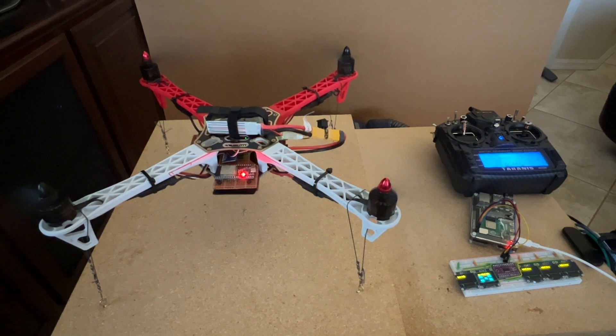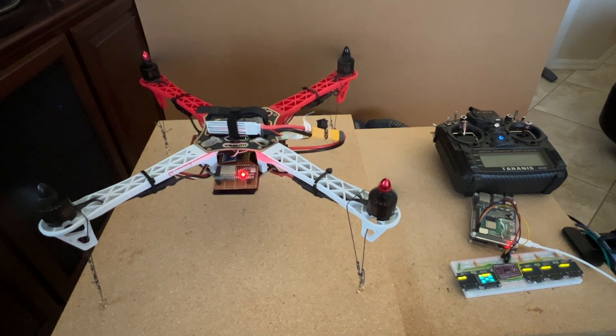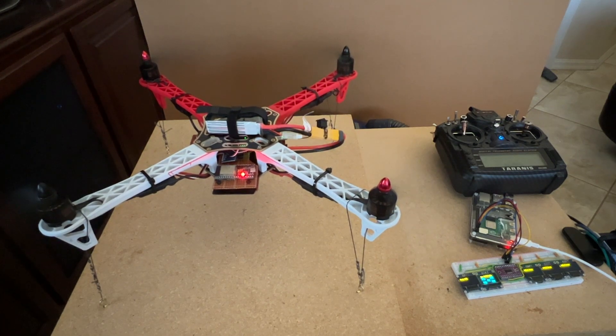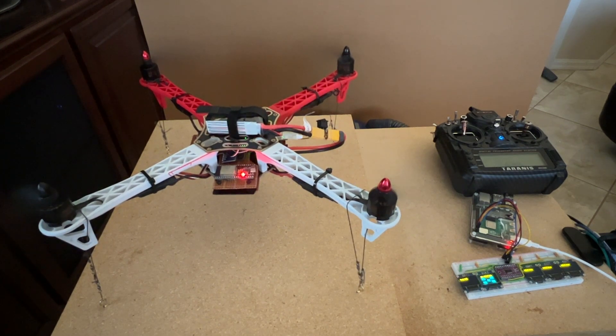I detached the audio and I'm recording on the clip. In the rest of this video, I'm going to discuss all of the components I've soldered together on the drone's breadboard and their interface to my external Raspberry Pi's displays. I am developing the flight controller code in C++ on an STM32F411 and the display code on the Raspberry Pi in Python 3.